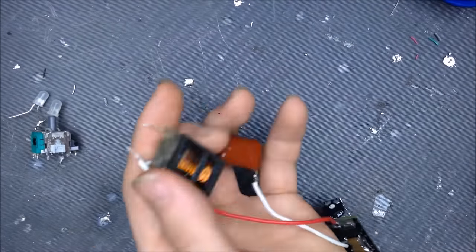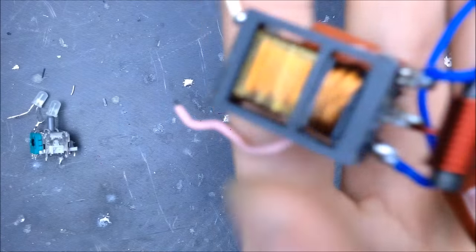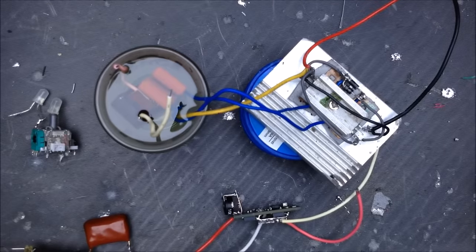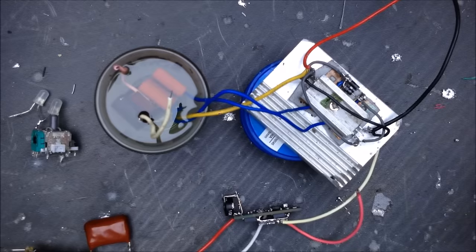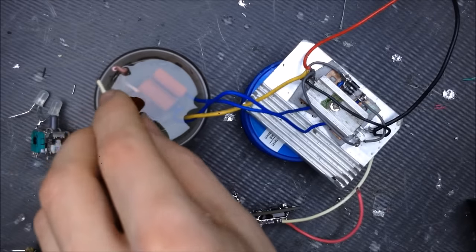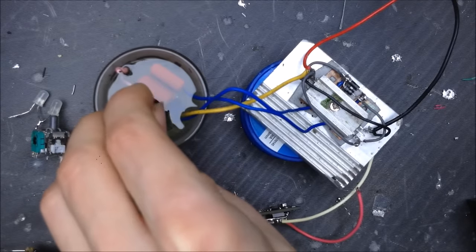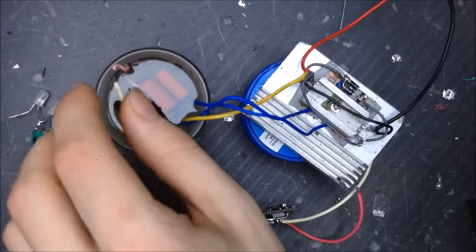So, what we're gonna do with ZVS now again. So turning that on. And now we have a ZVS coil that is the one with the thicker wire, but has a center tap configuration, but the exact same transformer as you just saw. I've tested out this ZVS driver, so I do know that the driver itself is good. And let's close this gap a little bit, see what we get. Initially, I'll let the transformer also bubble out.